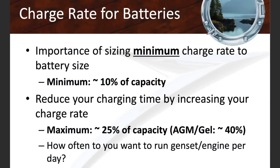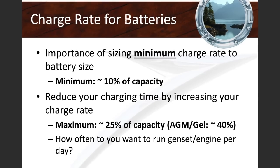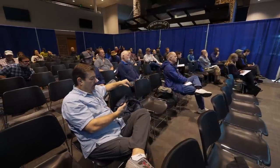There's also an upper end limit — you can't charge a battery as fast as you want regardless. AGM is theoretically around 40% charge rate, flooded around 25%, and lithium theoretically 300%. So with a 400 amp hour lithium battery bank, you could theoretically charge at 1,200 amps — but I can guarantee you there is no such thing as a 1,200-amp charger. The largest battery charger on the market is a 100-amp, 24-volt charger. You want a battery charger that's not too big, not too small, and realistic with your expectations.